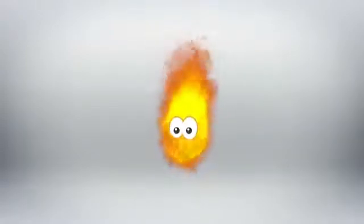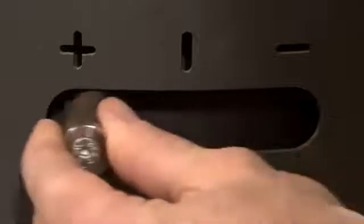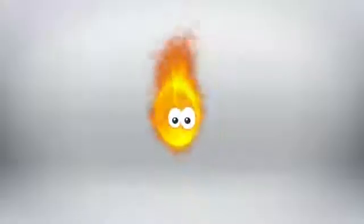Moreover, a fire also needs enough oxygen. That's why Ben turns and pushes the air knob to the maximum position before igniting the fire. If available, the shaking grate has to be opened too.